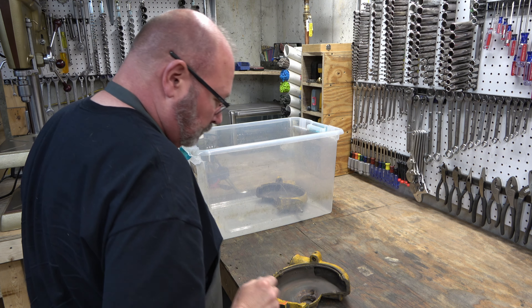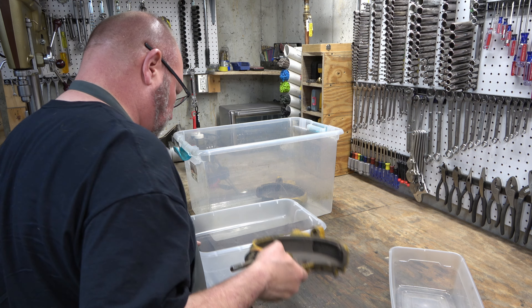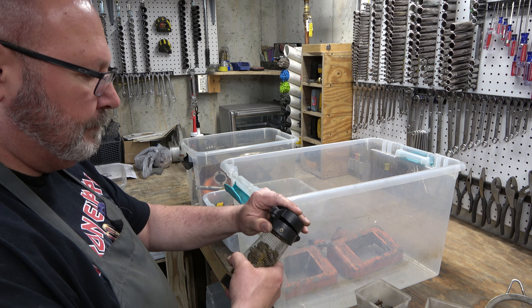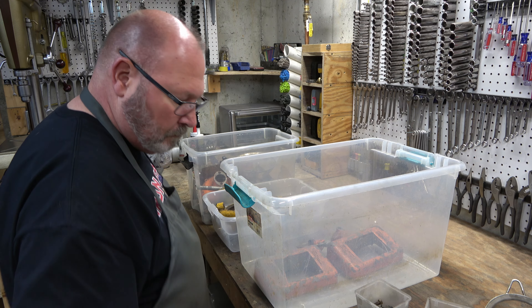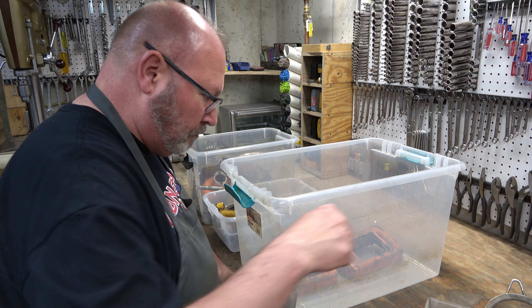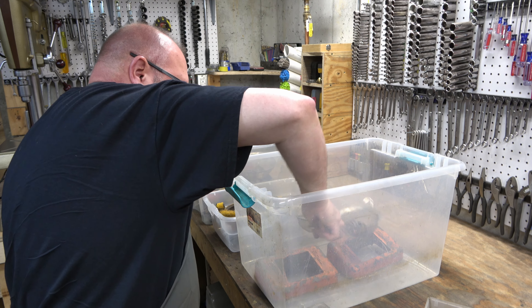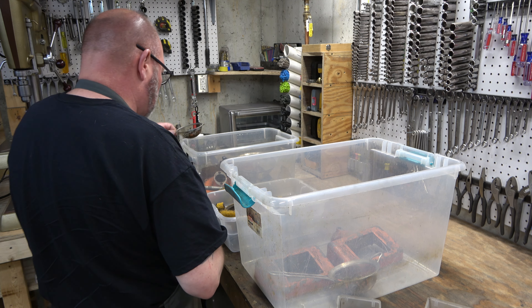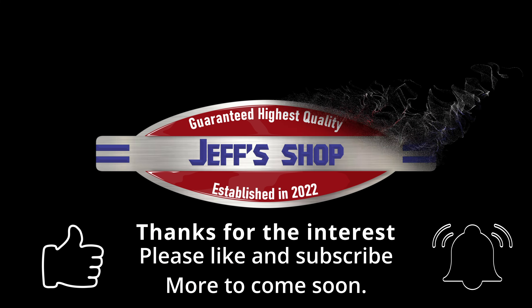The last thing we're going to do is soak everything in Simple Green. I ended up using several different plastic bins. All these parts, except for the panels, are going to get soaked in Simple Green — it'll help tear off a lot of that paint. Normally I soak stuff for about 24 hours, but this stuff ended up soaking for like a week and a half to two weeks. I wanted to get as much of that paint off as I could, and I had a bunch of other things going on. But that's going to wrap up this video. I hope you enjoyed it — if you did, please like and subscribe. In the next video we'll be cleaning up a bunch of these parts. As always, I appreciate the support and I will see you next time.